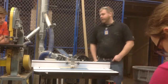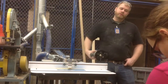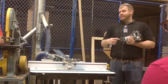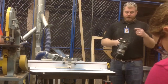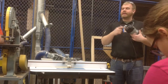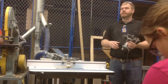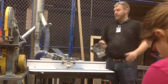Number five: never rest any part of the router against your body. If you're holding the router next to your body and you turn it on, sometimes you're going to have floppy clothes on — like a hoodie on a cold day. I don't want your shirt getting tangled up in the router bit. There's also a fan on the backside that when the router spins, the fan draws air in to cool down the motor. I don't want your shirt getting sucked up inside of that either. Just don't have this near you when you turn it on — have it sitting on a table or away from you when you fire it up.